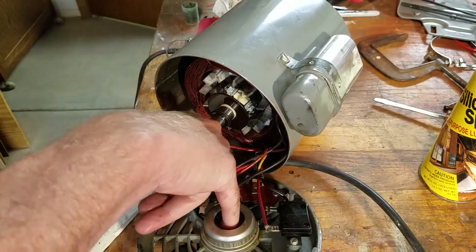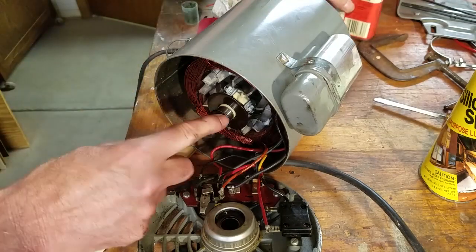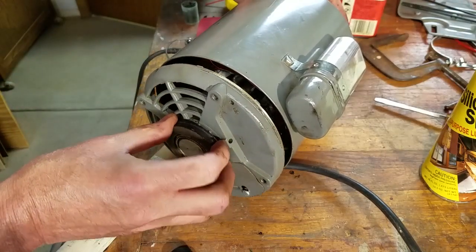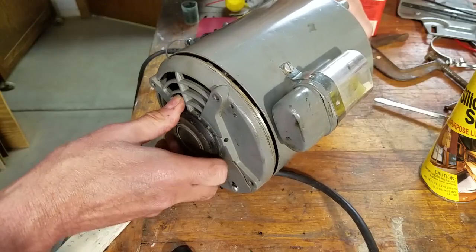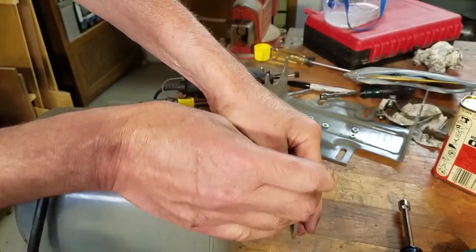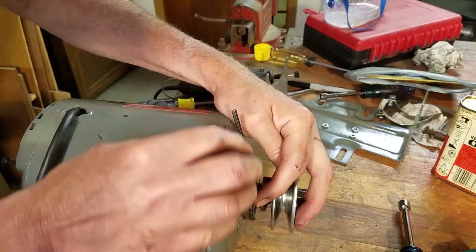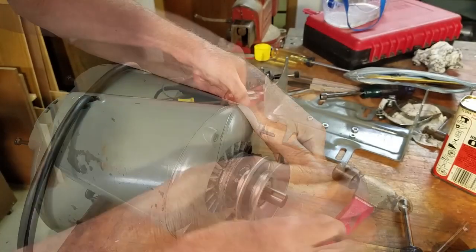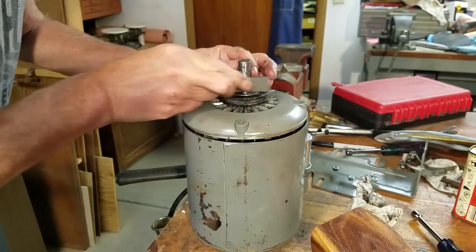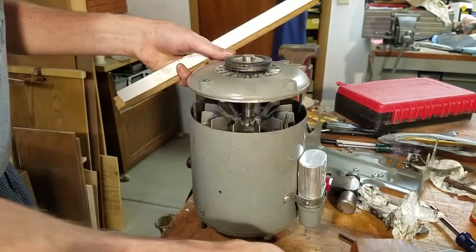While we're in here we might as well look at the front bearing. Let's put the rear end bell on to hold everything in place, put a little light oil on the shaft, then carefully line up the marks you made earlier and gently put the end bell on. On this bearing there was a little piece of felt that was used to deliver oil to the bearing — make sure that doesn't get caught between the shaft and the bearing. Before we remove the front end bell, remove the pulley and then clean up any burrs that are on the shaft with a honing stone. The bearing material is pretty soft and could be damaged by burrs during the removal. After the burrs had been smoothed out I still have to tap the end bell off.